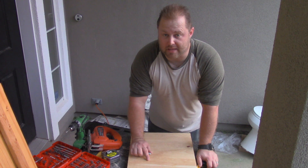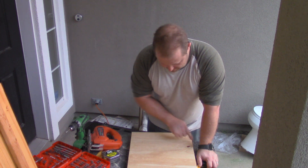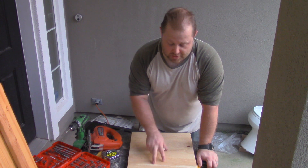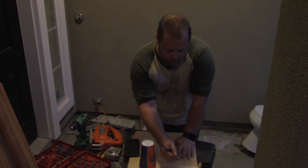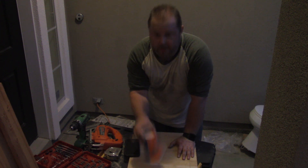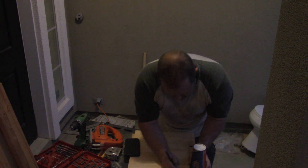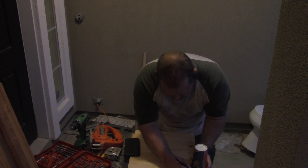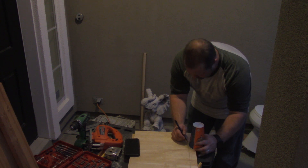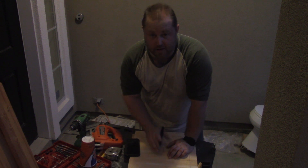I don't just want a straight square cut because that doesn't look nice, and I don't want cables to get caught on edges. So I'm going to do four inches in on either side and use something like a mason jar to make a curve and take that down the length of the board. Then I'll use this board as a template for the other shelf. I've made my four-inch lines on either side and a one-and-a-half inch line up, and I'll just trace an arc with a cup — you can use anything to make the arc look nicer than a square cut.